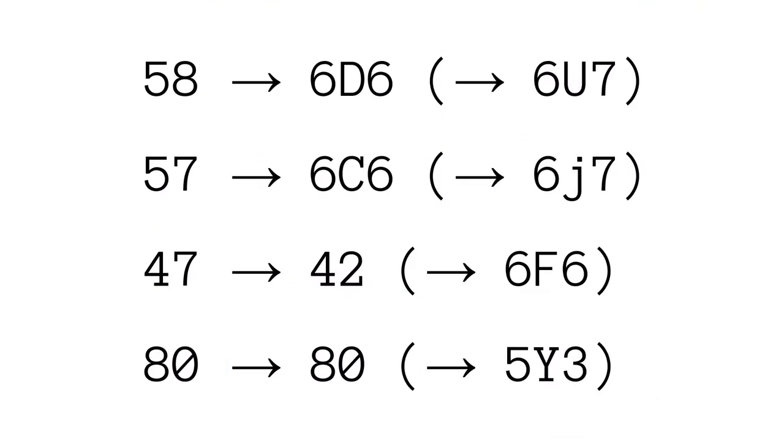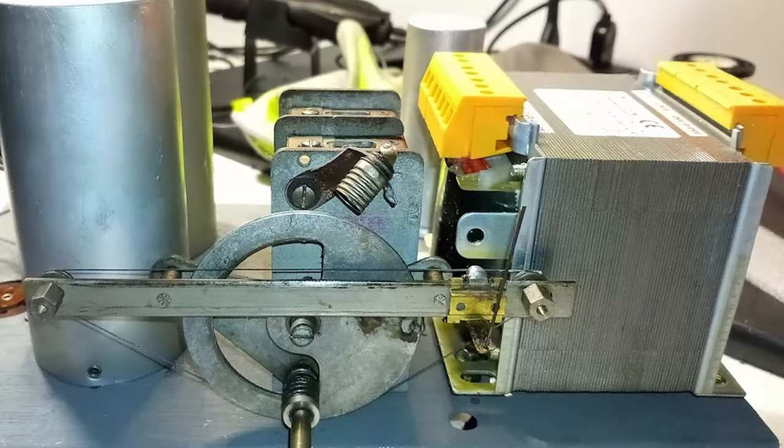A thought is given to the possibility of converting the set to 6.3 volts filament tubes of the same period of time, with the intention of making it easier to replace them in case of future failures. That would also allow replacing the power transformer with another one of a more suitable size for this small radio.